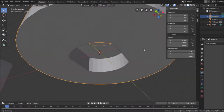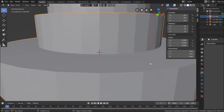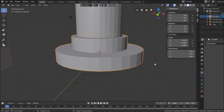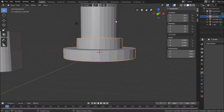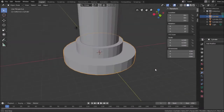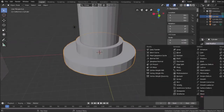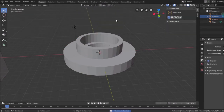And as I said, I wasn't going to make this a Blender tutorial, but you're going to get some of it out of it anyway, the way I think. So now when I punch this through here again, I will still have my beveled cut for this shaft in the original base piece. So with this item selected, I'm going to add a modifier for Boolean, and I'm going to use this object as my Boolean piece, and I'm going to use difference and hit apply. I take this and then delete it.